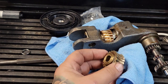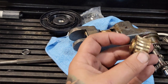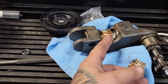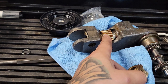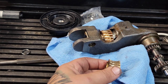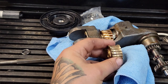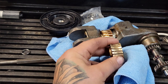One thing I wanted to note: on this Acra, it has a little built-in spacer. And if you get a Bridgeport replacement, everything's the same but it doesn't have that spacer, so you have to make a spacer for this side just to take up the slack between your bearing and the gear. There's a little bearing inside of there that has to seat. Other than that, that's pretty good.